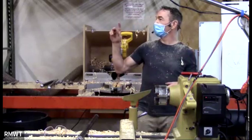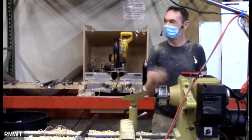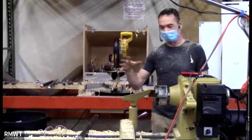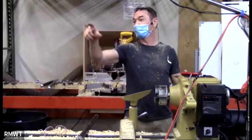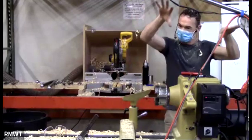And then the one that I think, Hoyle, did you ever work on the jet? So the jet lathe, it lives downstairs in the Rockler basement. The casting isn't flat. And so we stuck a piece of paper in this. So was it almost impossible to do the inside of the bowl, wasn't it? The vibration was, actually, it was the outside. He was doing some outside of the bowl. Vibration was so bad on a big jet. And everybody else was working on mini lathes to not have any problems because they got a fixed headstock. We lifted the headstock. We put a little piece of paper underneath and it disappeared because it gave it a locking point, not dirt in the middle where it rocks that little bit.